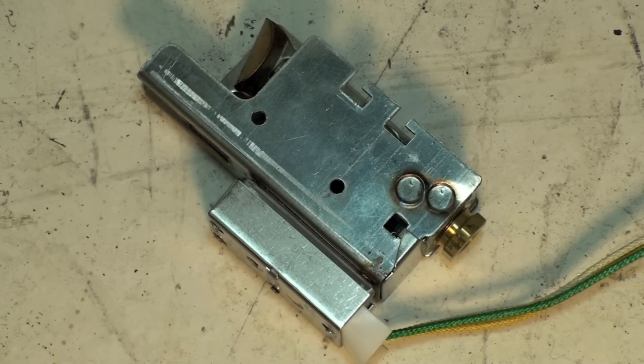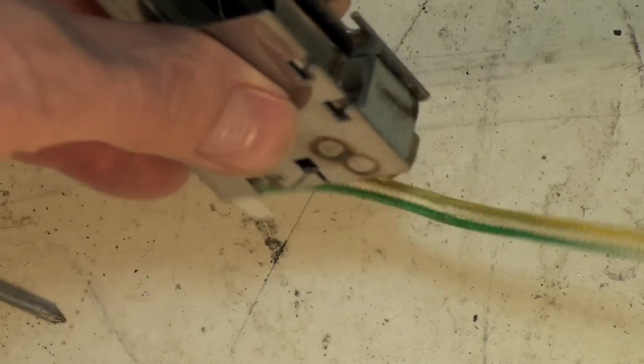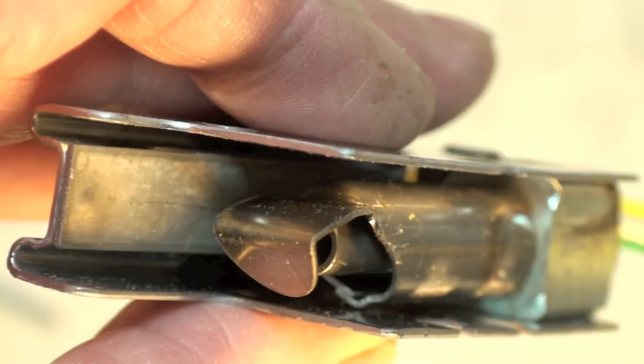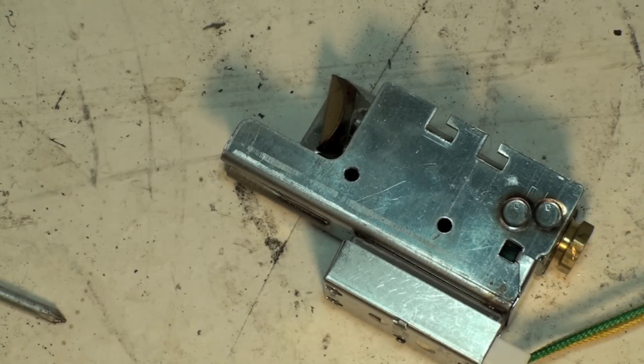Pilot gas comes through this aluminum tube right here, feeds gas through it, and lights the pilot through a spark igniter. Some pilot gas comes through, the spark lights it, and then it warms this little bimetal — you can see that bimetal right back there, that flap thing in the back. The pilot warms it up and it warps over, changing the position of the switch.